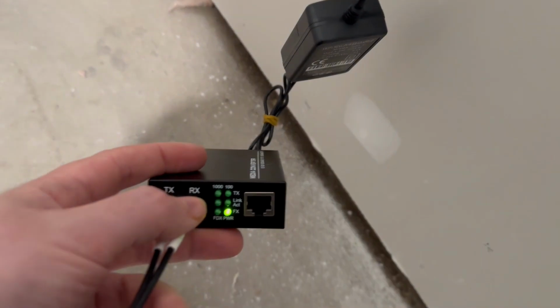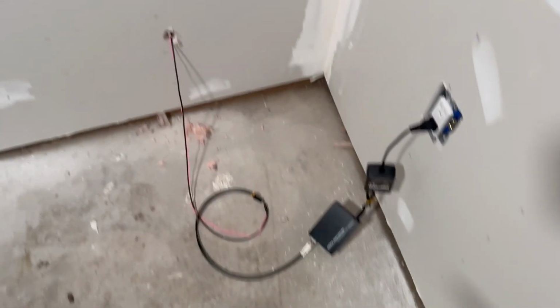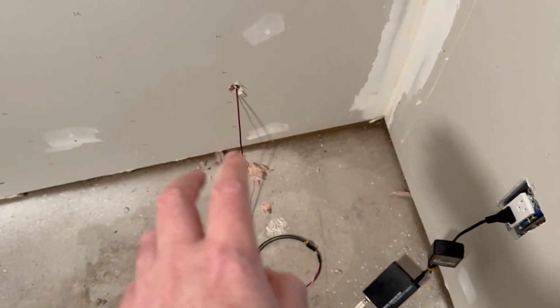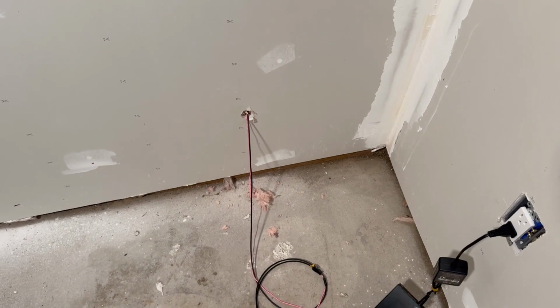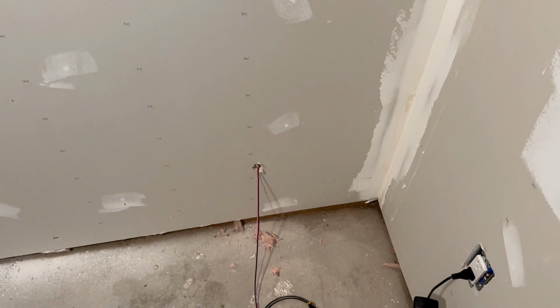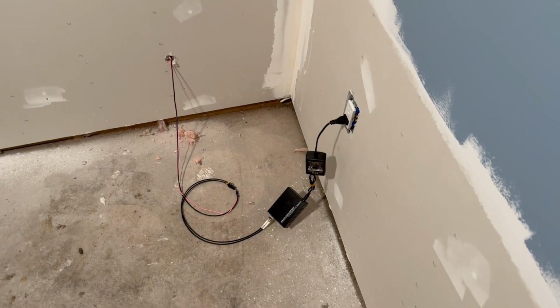And then the Ethernet cable from here will go into my desktop, my tower, and it gives me hardwired computer access. Now, a couple things. Obviously, we're still doing drywall and stuff here, so I'll remove it because of the dust. And there's going to be a wall plate that goes on there. You get special wire ones, which you'll probably see later on in the build series. And on the outside, make sure you silicone caulk the conduit that comes in the wall, so no water can get in. A couple of things there, but yeah, pretty easy.